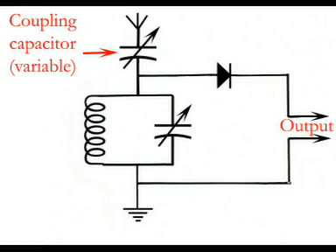Is there any way that we can keep that capacitance at bay but still let the signals in? There are two or three ways you can do that. One of them is to put a coupling capacitor in the aerial circuit, and that is usually quite effective. All we've done is add another variable capacitor between the aerial and the top of the tuned circuit. It will enable us to vary how much of the signal gets into the tuned circuit, and also keep the capacitance of the aerial at bay.